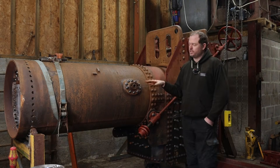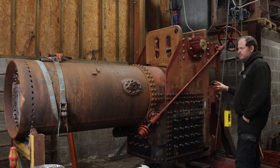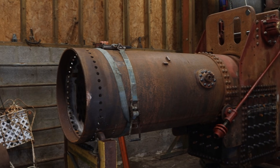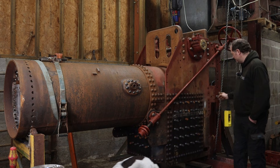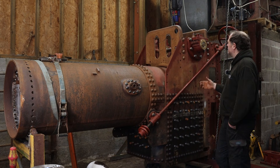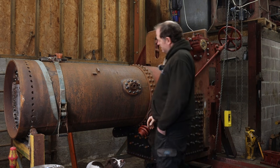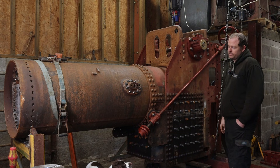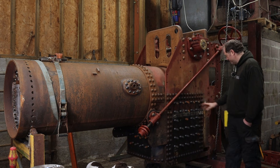So that last clip showed what's been done on the rebuild since — and even before — I've had it. It's had a new barrel, new front tube plate, a throat plate, a patch in the horn plate, a patch in the back head, a new firebox, new foundation ring, and spectacle plates. Anything else needed boiler-wise has been done. The front tube plate has been drilled and is ready for riveting. I'm just doing the smoke box now and we'll touch on that in the next video. The stays have all been fitted and just need trimming and riveting over.